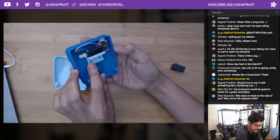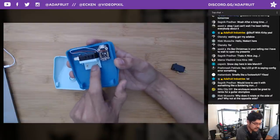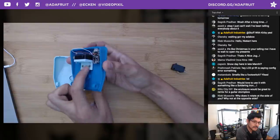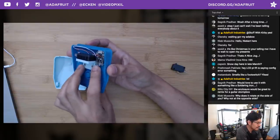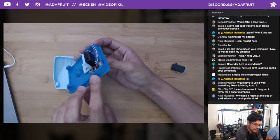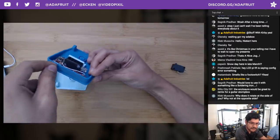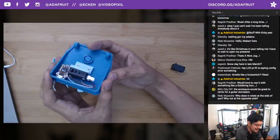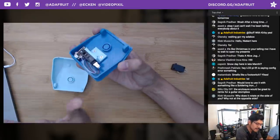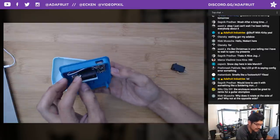Other thing you have in here is an L bracket that secures the micro switch to the base. And when I first designed this, I got this idea from the actual foot switch, the one that we carry in the shop. And I thought, oh, I can probably just merge the two parts together. Why would I need to make a separate bracket? When you're 3D printing, you have that luxury of making all sorts of crazy geometries. So I did do that, and then I realized, wait a minute, because of this lip, now I can't actually get my screwdriver into the case. So you could do it from behind here, but then you would need a washer or something here. So there's always reasons for design things, and I had to learn that the hard way.